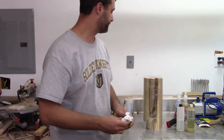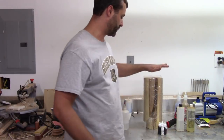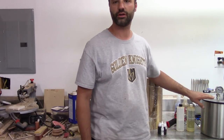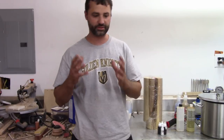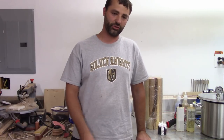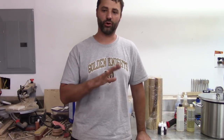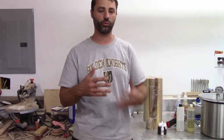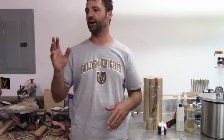We'll see, you know. Next thing I did, so we gotta mix that up. We gotta make the acrylic. I also have a chamber pot now, or a vacuum chamber. I have a video from years ago where people wrote me about a bowl I did with wood chips and acrylic, and there were bubbles in it, and people gave me all types of suggestions and advice, and they kept on saying, oh, you have to use a torch. The torch did not work when I used it. It momentarily works, and then if there's too much oxygen in there, you're still going to end up getting bubbles. When you walk away, just from the chemical reaction of the heat and everything else, overnight bubbles appeared. So I don't mind how the bowl came out, but people kept on writing me. So I got sick of hearing it.